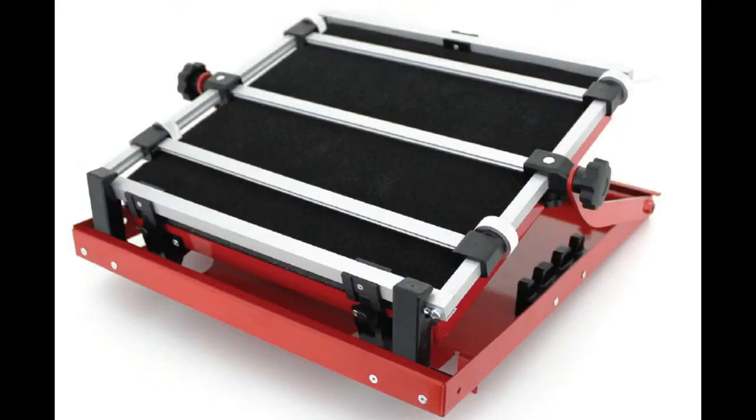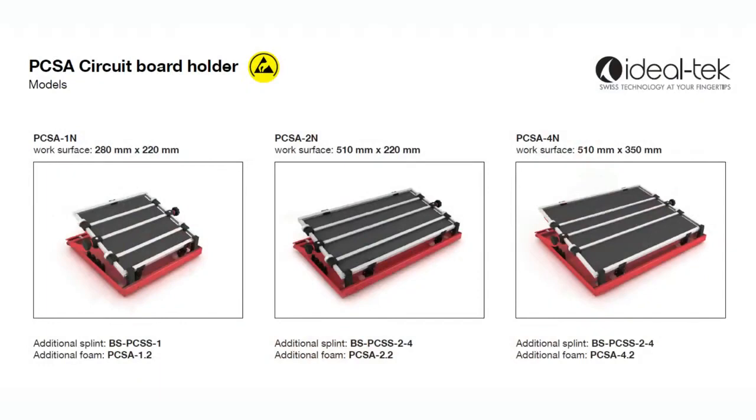So this is what it looks like, and I've got one here and I'll demo it live as well. These are PCB rework holders, and they've got a lot of little details. They're low-cost and small, but if you're going into production work and doing a lot of soldering, there's a lot of details that can save you time. These holders are available in three sizes — colloquially: kind of large, big, and huge. I've got the smallest one and it is still quite large. They have multiple railings and are not designed for a single PCB. You're expected to put in a panel of PCBs, or 10 to 20 at a time, because you're soldering or reworking a bunch of the same board at once. That's why they're so large, but the large size also gives them strength and heaviness that makes them stable. There are three in this series: the PCSA holder series.